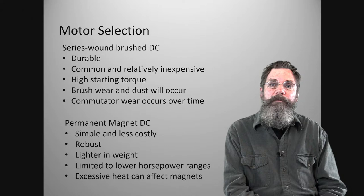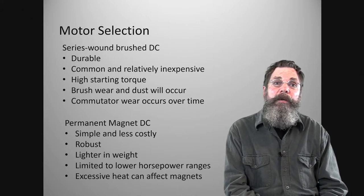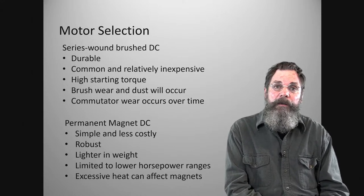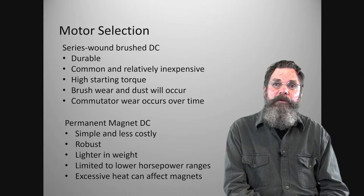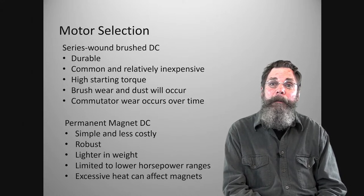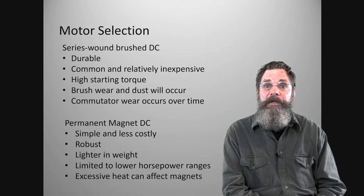Forklift motors are fairly common in surplus circles. New motors, Advanced DC, NetGains, another version of the Advanced DC, and a host of other manufacturers make several varieties and voltage ranges. This particular motor can take a 24 volt to 72 volt direct current input, and that's a wide swath of availability there.